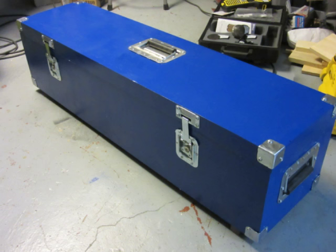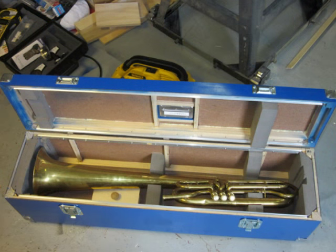If you position a handle in the center, the case often hangs odd when you're trying to carry it due to very asymmetrical weight distribution. It has a semi-monocoque structural design with lightweight pine stringers and masonite panels. It's padded by selective foam blocking.